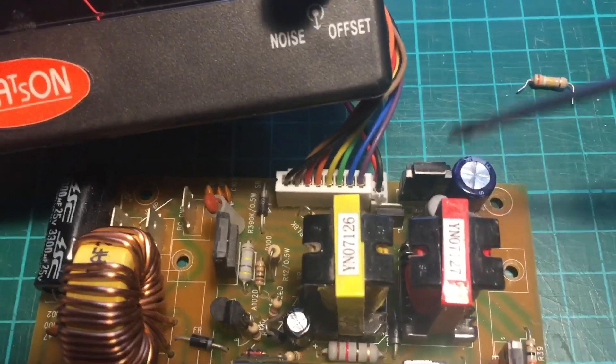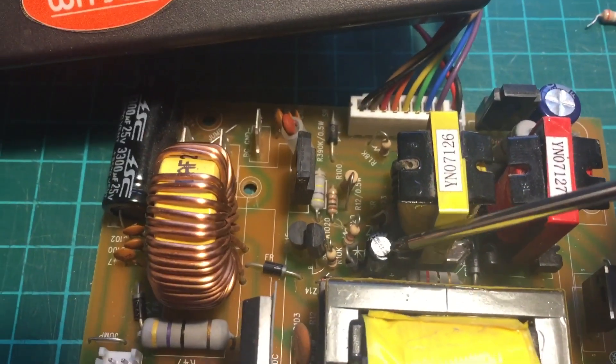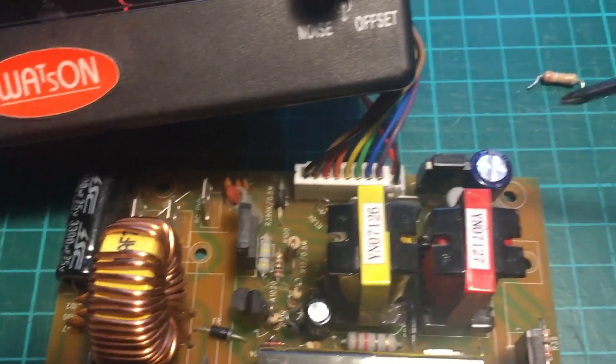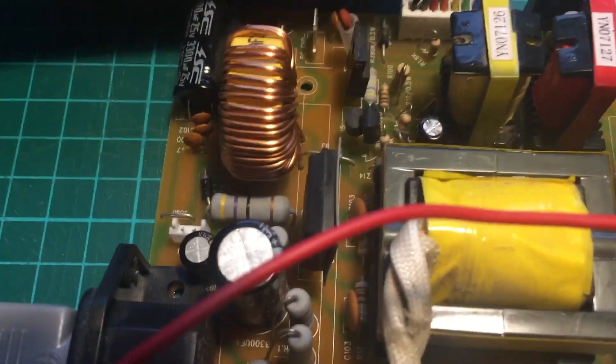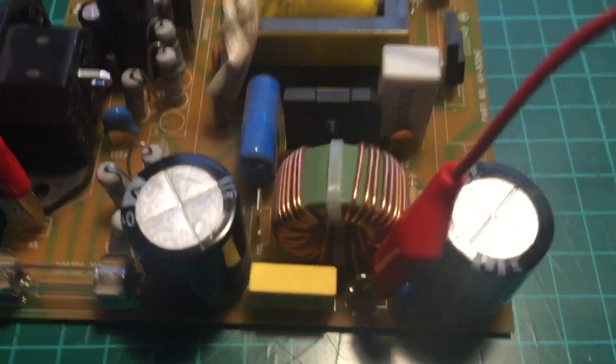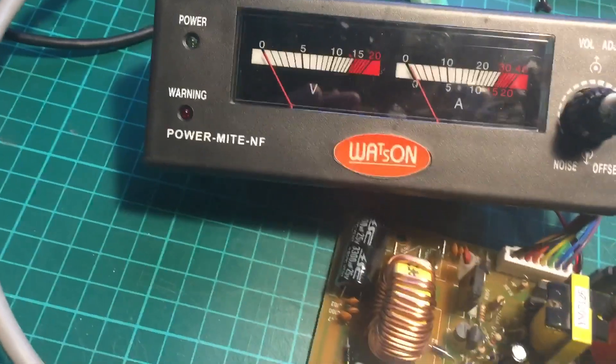Checked this device transistor, and basically just went through this one on the end there. They ended up changing the usual cap there. There was a cap over there I changed. I haven't done the larger caps — generally in these sort of power supplies they're okay. But I found the fault anyway, doing it the old-fashioned way, checking every single component.